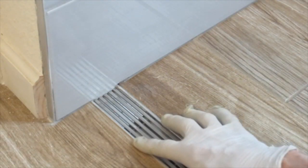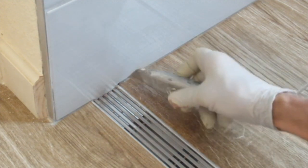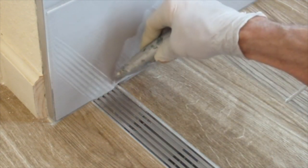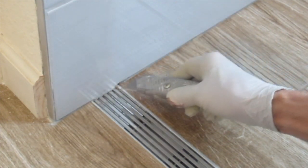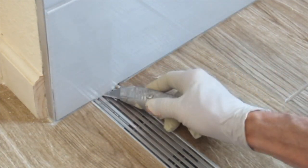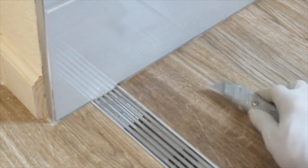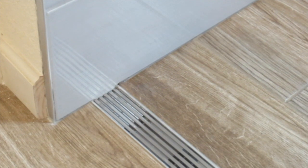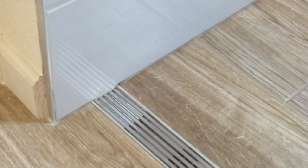Finished drain with the Schluter floor-wall tile. With the wall tile, I like to notch it so that it goes down deep into the drain extension, just so that the drain butts up against it rather than cutting it straight across and leaving a void. I've got my drain extensions in there to bring it up flush to the surface, and that's a done deal.